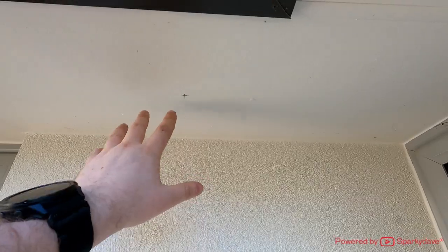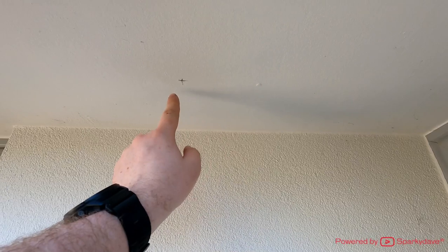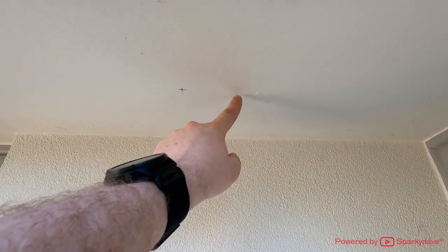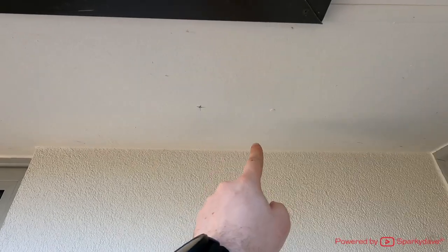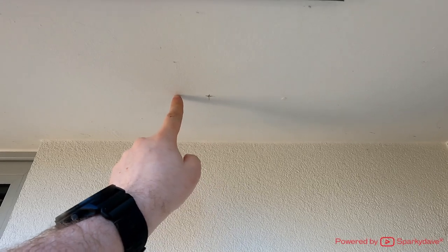Given that it's a 159–160mm cutout I'm doing, I have to allow for 80mm clearance from the timber to the center. I've estimated 20mm for the timber and then left 100mm extra to the center point of my mark. If I wanted to be safer and wasn't sure of the timber thickness, I'd bring it out further left — maybe an extra 20 or 30mm — and that will eliminate any possibility of drilling where there's timber in the soffit.